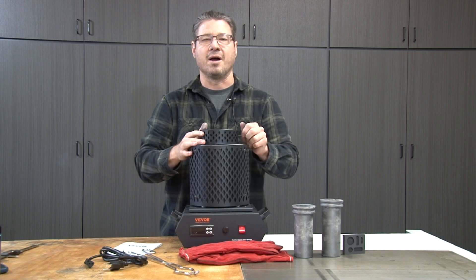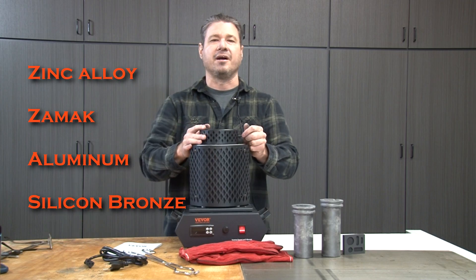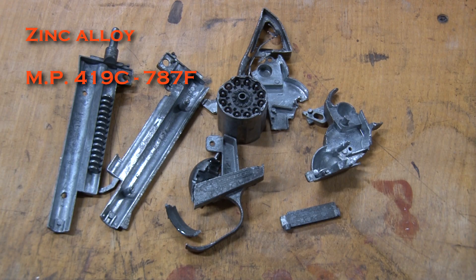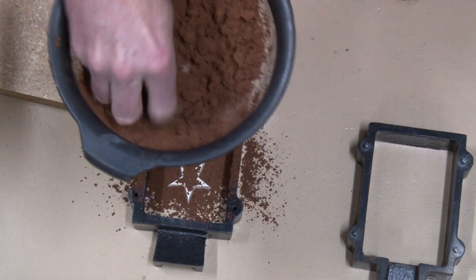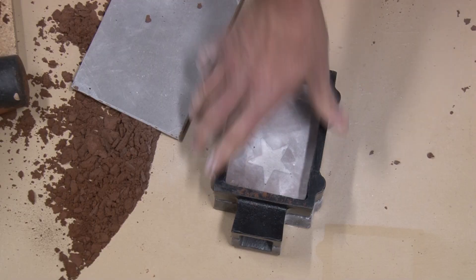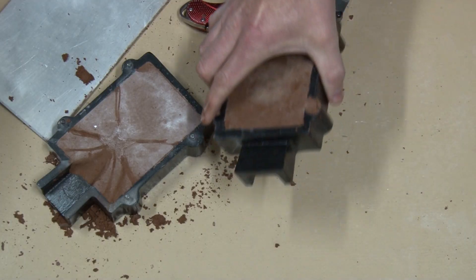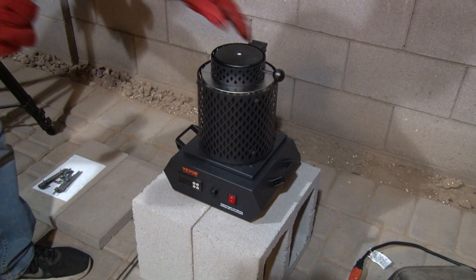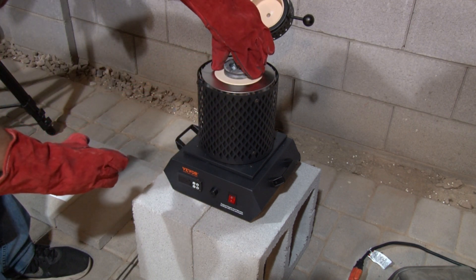I'm really excited — this electric furnace has quite a range of temperature, which means in most of my videos I cast aluminum, but in this one we're going to use various metals and see what we can cast. This is a die-cast zinc from my son's cap gun. It broke, so I thought we'd start with the lower melting point metals and cast a star. Right now I'm packing up the mold, adding parting powder, filling up the backside, cutting traces for the zinc to flow. There I am loading the zinc in — all loaded, though I still want to add more zinc but the crucible is full.